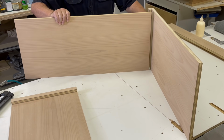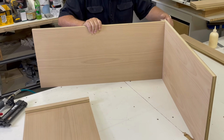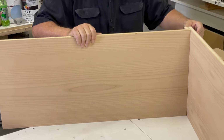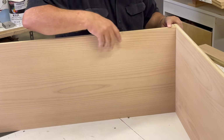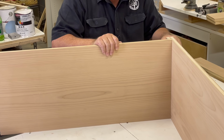And our bottom shelf fits against our cleat and creates that extra support and measurement that we're after. We'll make a couple of nails from the outside and even one or two down from the top, just to make this a really good, strong, square joint.